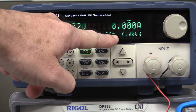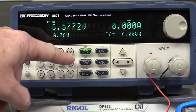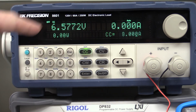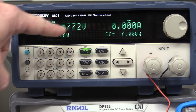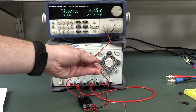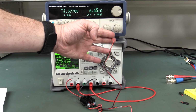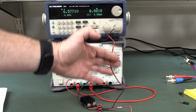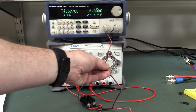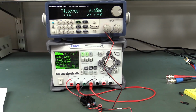And we can set the output current. So what I'm going to do is actually set the constant output current to, in this case, 8 amps, and it'll tell us the output power, and in this case it is actually telling us the output voltage. But we need to do one more thing with this setup, because these output leads are really quite wimpy. At high currents, like we're talking 8 to 15 amps here, we're going to get serious voltage drop across these leads. So we're actually going to get power dissipated into that, and our figure on here will not be accurate for our output power.